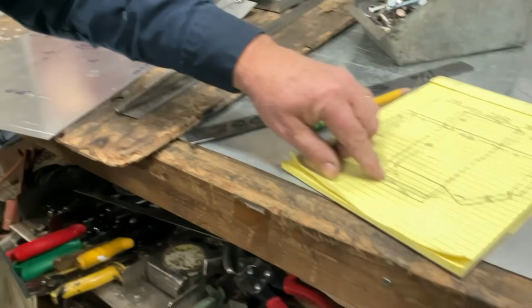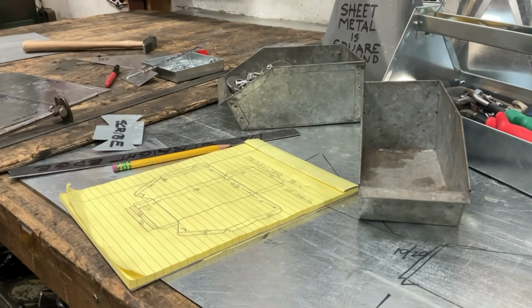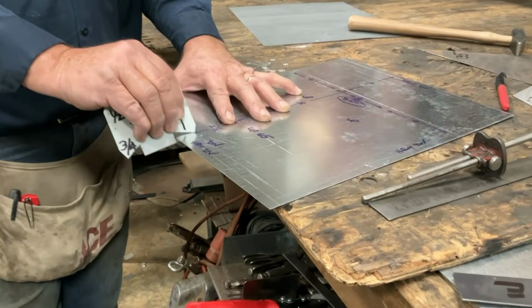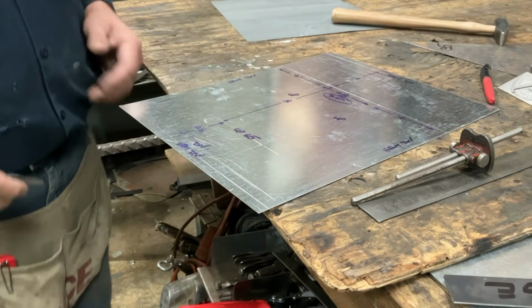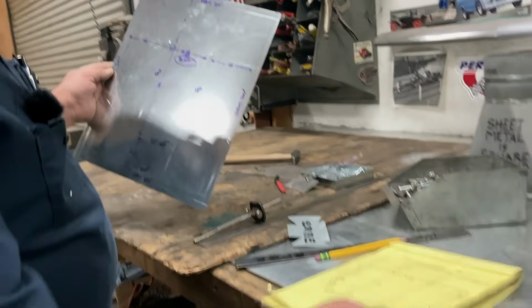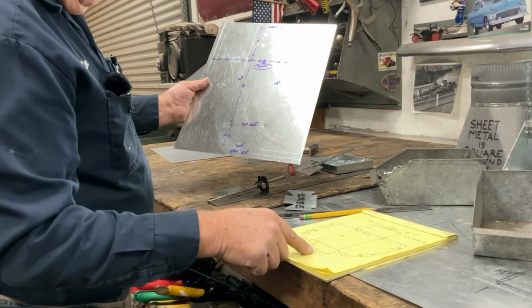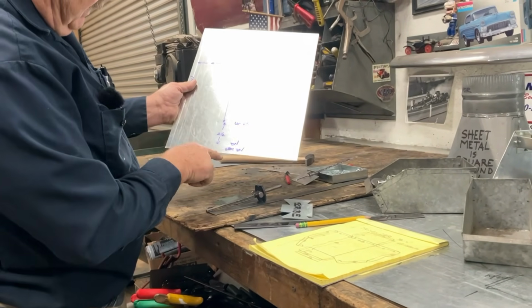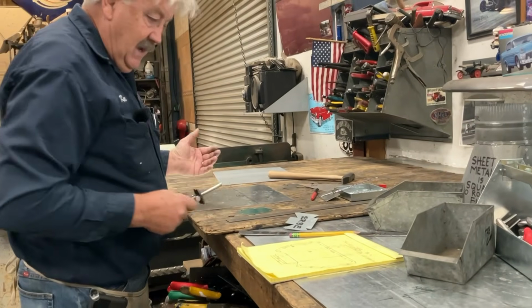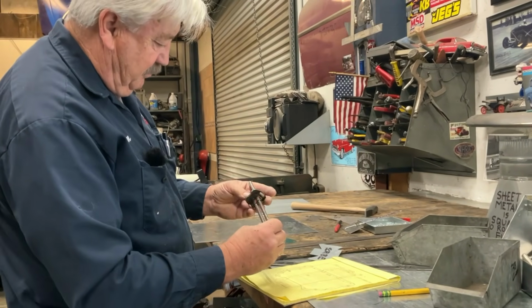Now in the front of our handle, we have a 1/2 inch bend and then a 1/2 inch hem. So that allowance together, 1 inch. Here we have an inch right here. So let's go back here, add in that 1 inch line. So now what we've done is we've transferred our drawing to the metal. So far all we've done is go around the perimeter, added the 1/2 inch hems on all 4 sides, and then we came back and revisited the front and we added that second 1/2 inch for the handle.